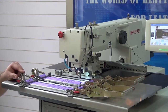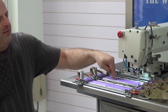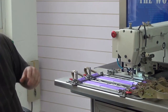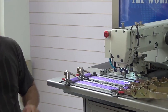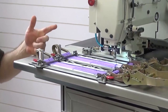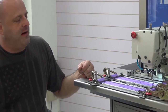The cycle time on this machine is well under 30 seconds — we've successfully sewn two ratchet straps in well under 30 seconds. When the machine finishes the sewing cycle, it automatically auto-ejects. All you have to do is take the old clamp out, bring the new clamp in, initiate the clamp mechanism, and initiate the sewing cycle. There are just two pedals: one releases the clamp, one begins the sewing cycle. Operating this machine does not require an incredibly skilled operator, which helps keep labor costs down and production time high.